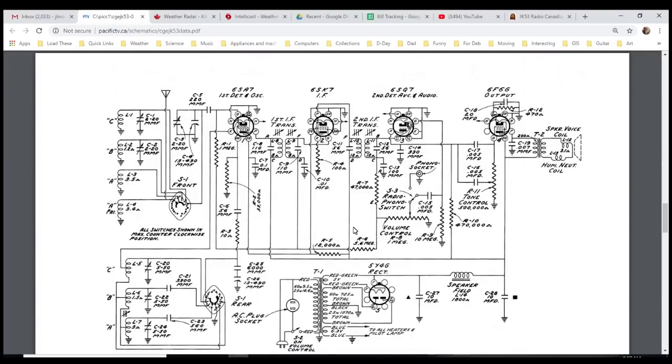That's why, when you tune an AM radio between stations, you hear all this incredible noise — but when you tune in a station, the noise is driven away. It's because the automatic volume control is going up and down. Between stations, the radio turns itself up full blast, so a little bit of noise comes through the speaker loud and clear. If you didn't have this, when you tune between stations the radio would just go quiet.